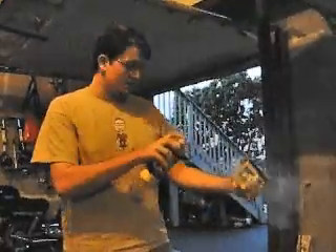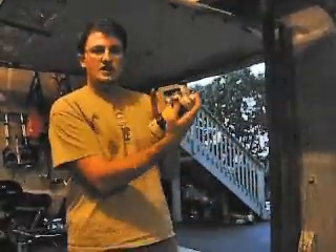I've taken a couple extra Lego pieces and put them around the outside rim, a little higher than the part itself. This will create a wall to pour the rubber right on top of. Lego are surprisingly airtight — very little rubber, if any, will actually leak into the cracks. It's a fairly viscous substance, so you don't really have anything to worry about. Now we take the mold and our mold release spray, shake it good, and give the part a nice spray down. Try to keep it away from you — I'm not sure how healthy this stuff is. Make sure it's got a nice even coating on it, so that when you pour the rubber on top you'll be able to separate the part and the rubber; otherwise they stick together and you'll never get them apart.